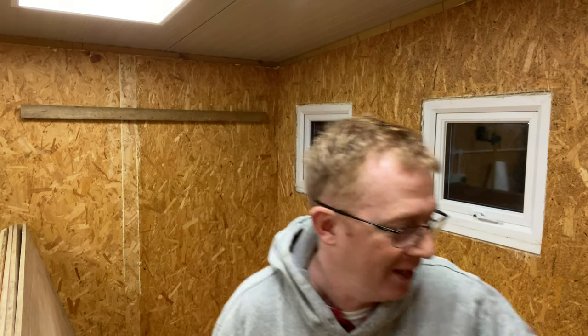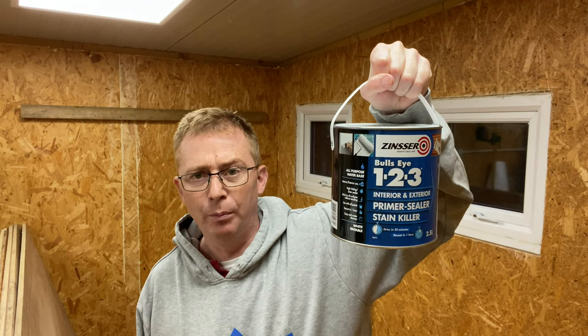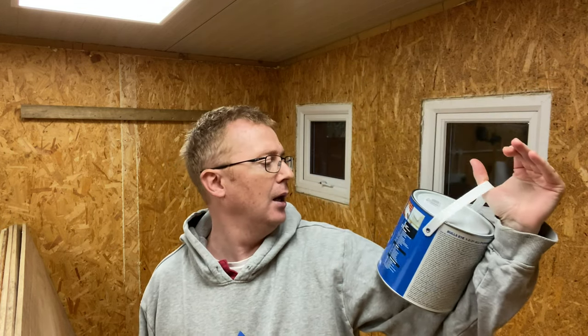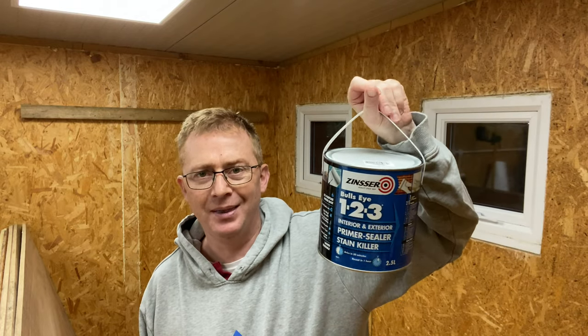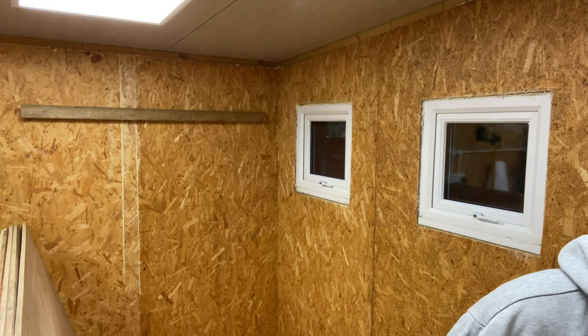Now, if you do your Google search and your research and your YouTube search, there is a huge amount of conflicting advice on how to paint an internal OSB wall. But one thing they are pretty much unanimous about is the importance of a good primer. Hence the little intro before the video. And this stuff, which I've bought some of, which is Zinsser Bullseye 123. Now, I think it is regarded really as the best in its varieties of products that it does.